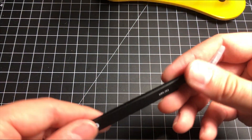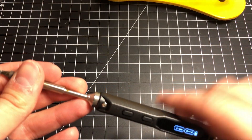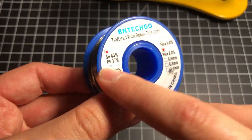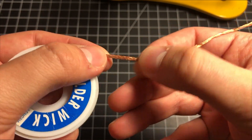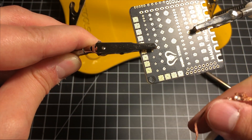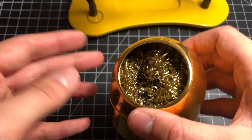This is an electrostatic discharge tweezer — really useful for holding a wire down. We've got my favorite soldering iron of all time, the TS100. I did do a review of that iron and you can check that out if you want. This is my favorite type of solder for electronics: 63/37. That's what you want — it has a much lower melting point, which means you can use a lower temperature on your iron. You've also got solder wick, which lets you remove solder if you make a mistake. And this is a brass solder tip cleaner — so much better than a sponge.